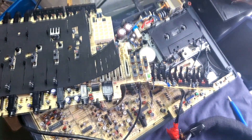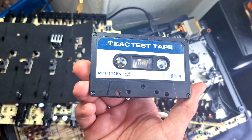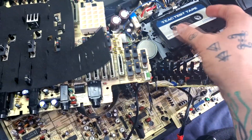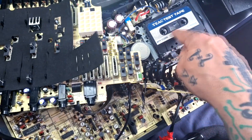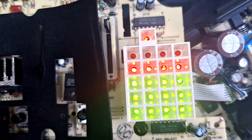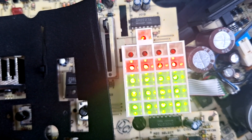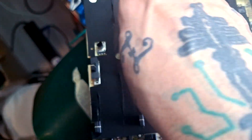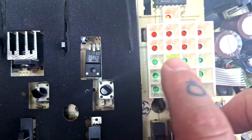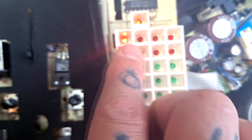This is a Yamaha MT120. This is my Tascam test tape. Track four is a little bit quieter than tracks one, two and three — I don't know whether it's tape curl or the way it was recorded. The levels from the tracks are all pretty even. If I turn over to stereo mode, I've got both of these cranked. If I turn them both to the right, I'm reaching this LED.